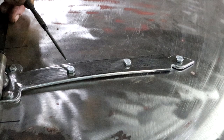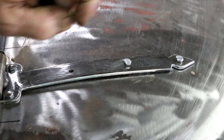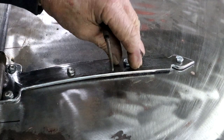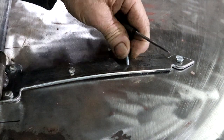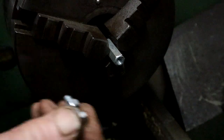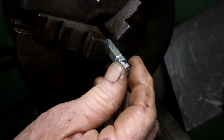So I don't like the look of these common bolt heads. So what I did was this. I think that looks much better. Looks almost like a rivet of sorts. Don't you think? So I just chuck one of these extension nuts in my lathe. And then I'm going to take my M6 bolt and screw it in there a little bit,